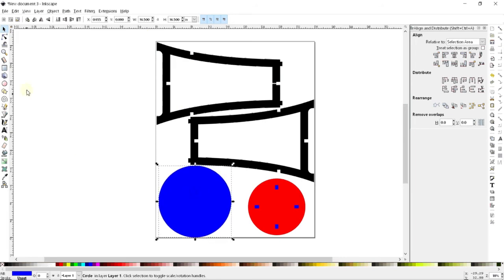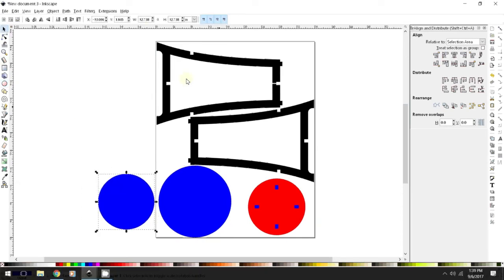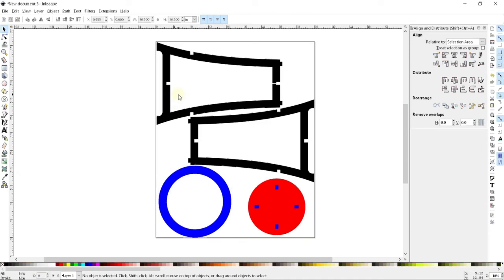And now I can get to work on the inside dimension of this. And that's just going to want to be a little bit smaller than the smaller of my two numbers that I measured earlier. And so since the smaller of those numbers is 13.2 inches, maybe I'll make this 12.75. Sounds decent to me. And now I'm going to simply overlay these two on top of each other, bounding box midpoint to midpoint, and simply subtract the two.